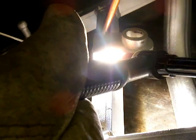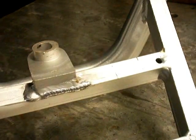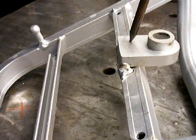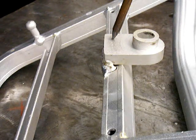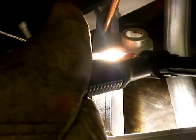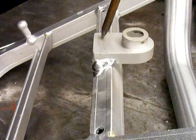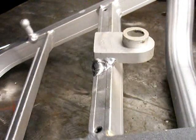It's not going to weld pretty because of the nastiness and oxidation inside that fractured crack. I felt pretty confident the weld was going to hold, but I was not proud of it at all — it just kind of looks like crap, but if you look at the welds on the rest of this thing, they kind of fit right in. I'm going to hit it pretty heavy on those edges. I can't weld on the other side because something goes up against there and it probably won't fit. No writing home about these welds, but they're solid. When you start welding and cooking stuff out of cracks like that, you're just trying to get some metal in there and get it to stick — it's not going to be a nice pretty bead.